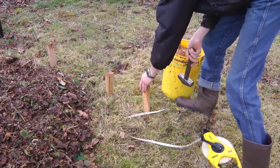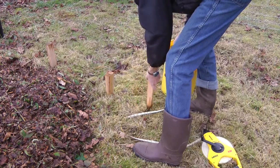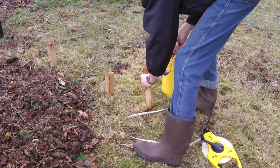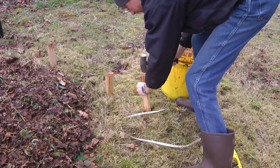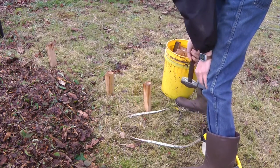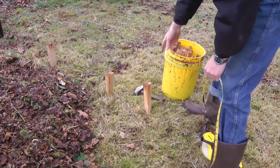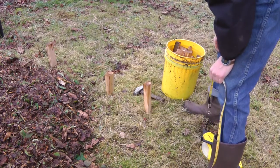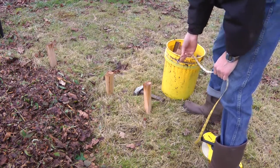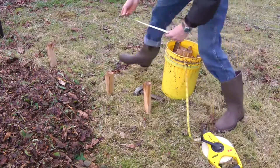Look down at, make sure all the stakes are in a line. If they're off, don't just leave it. Yank your stake and try again, because otherwise it'll get off down the row. Sometimes you have to keep measuring over to another position, to another right angle, to make sure you're not off by so much, because otherwise it causes problems.